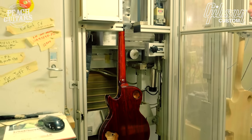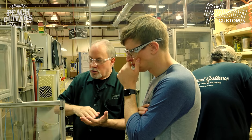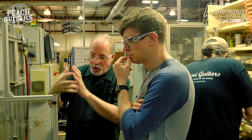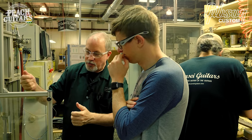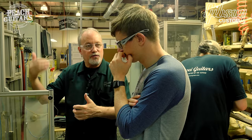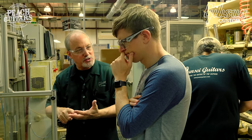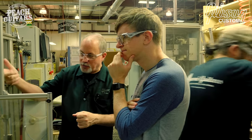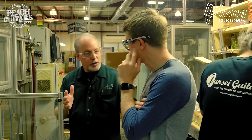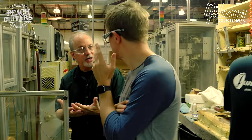So our machine was customized. When they put the bracket on the headstock and lock the guitar in the machine, before it starts to scan the fingerboard to take measurements of the frets at each place where the string crosses, they flip the switch and it pulls on the neck. It gives you the tension equal to having a set of tens on it.